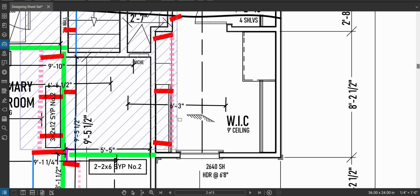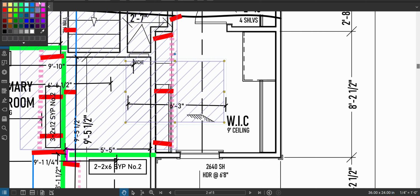So what is the load area like for this roof brace? Well, halfway from here to here is here. Here to here is here. Okay, and then I'm going to do the left-right tributary width as well, and it's going to give me this kind of rectangle right here. So that's the loading area. Change of color. That's the loading area for this one brace. And this one brace is actually the worst case scenario one.